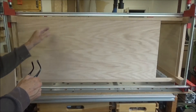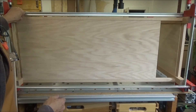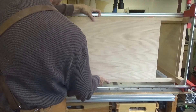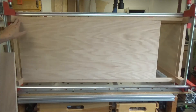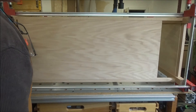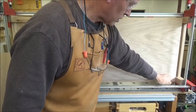I'm taking the middle shelf and using it as a template. I got very lucky because I thought I left a little extra and it just fits. This has got a little bit of a bow in it and I can pull that together when I glue it up. The important thing is that the corners are right on the money. I slide this down to the other corner and it's nice and tight down there as well, so I've got to mark and cut these notches.